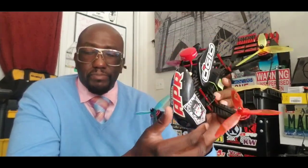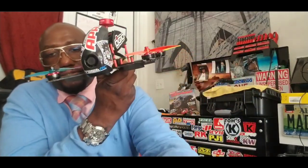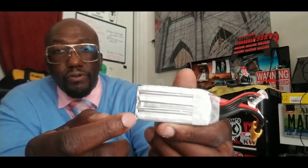It's already got the radio built in and everything you need to use the goggles. Now, the batteries for this machine — because it's so powerful, they don't last long at all. This 280 millimeter model uses 4S batteries. The ones I like to use with this quad are these Tattu batteries — good, strong batteries. 4S means how many cells they are: one, two, three, four. This one has a 1500 milliamp battery with 50C burst.